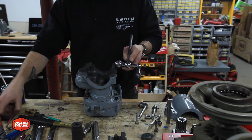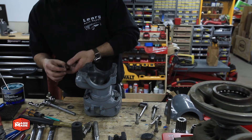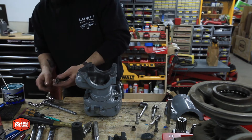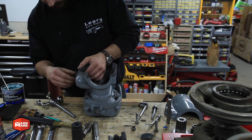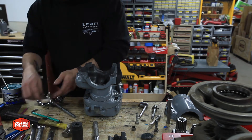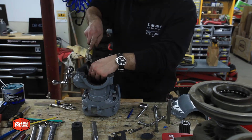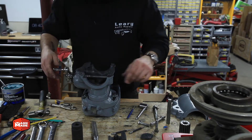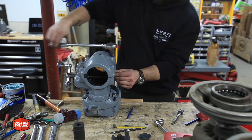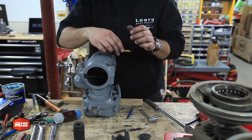This is the main handle that goes through the assembly. First in is a spacer bushing. Here's that taper pin again — this time it went smoothly putting it back in. I put a little grease on the bottom of the gear, though these two gears are typically meant to be oiled rather than greased. Now reassembling that casting with the bolts in the rear and the locking handle.